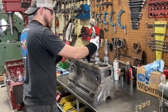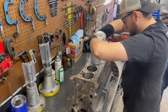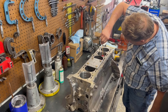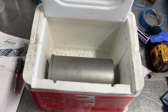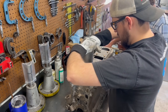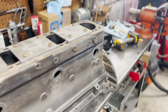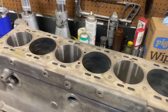Our process for installing the first three sleeves was as follows. With the heated block on the bench and one sleeve soaking in liquid nitrogen, my dad adds a coating of Loctite 620 around the water passages at the top of the cylinder as well as a band around the bottom of the cylinder just in case. I spoke with an engineer at Loctite who told me that this technique would work well and at 250 degrees on the block we were well under the max temp for Loctite 620. He also said that the cold of the liquid nitrogen would be no issue as it's only that cold for a split second. I then carried the sleeve over and quickly but carefully pushed the sleeve down into place with the flange against the counterbore, then installed a plate over the cylinder to keep it from pushing out of the block. Our thought process was to get all three sleeves installed and plates over them while the block was hot before moving over to the press and pressing each plate and torquing the bolts to ensure that the sleeves were all the way down before the Loctite set up, which has a listed cure time of 60 minutes. It was a bit of a stressful process and by the time we got to the press it seemed like the Loctite was already acting, and it took a good amount of pressure to fully seat the sleeves against the counterbores, but we got it done.